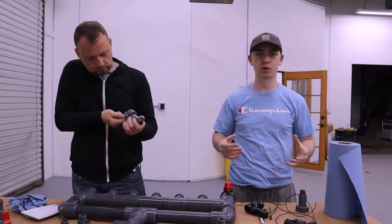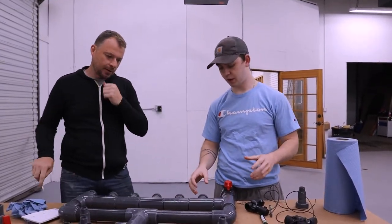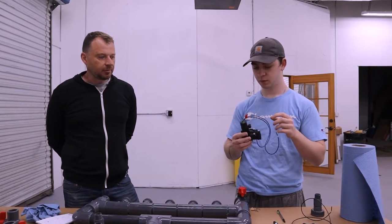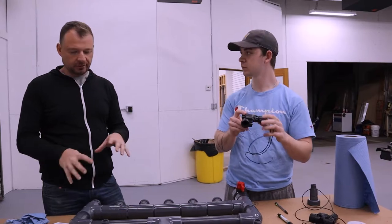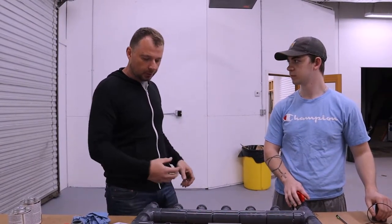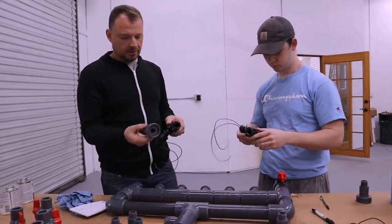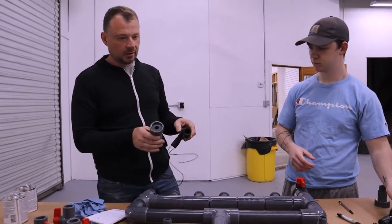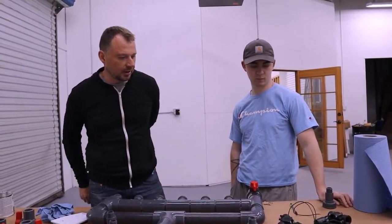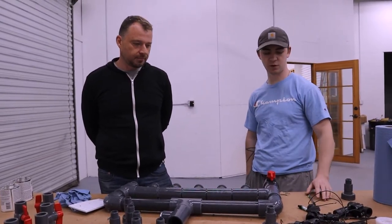Welcome back — it is now day two. What we're doing today is cleaning all the glue spots out because you don't want any debris going through into the solenoids. There's a small orifice in those, so when you first fire up your system the shavings and debris can clog up the solenoids. That's also another reason why the solenoids are on unions — for maintenance and cleaning, because over time they will start getting clogged, you'll lose water pressure, and you may have to clean them or repair the O-rings. That way you can replace just one or replace everything if one breaks.